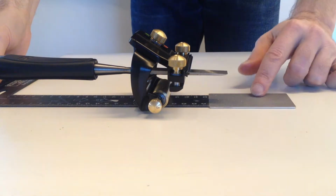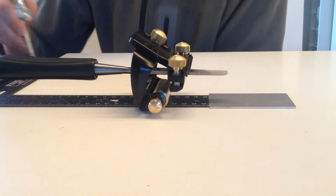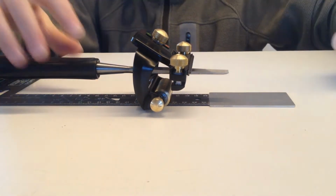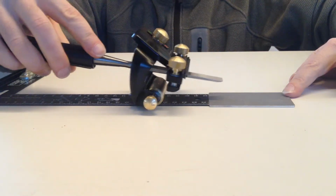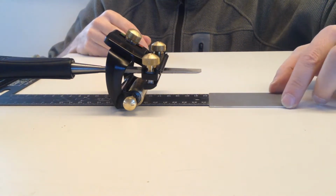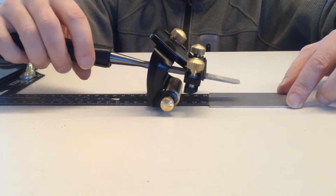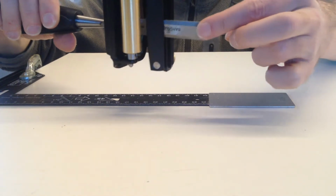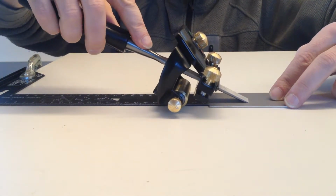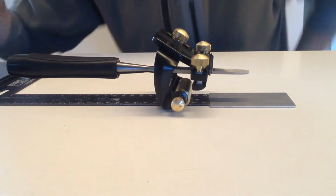What I do is that I'm going to try this setup. So I will fasten my square to the bench. Doesn't go anywhere. Like that. Now this is a smooth surface, they are on the same level, and I'm going to start with the 600 grit setting here, and I'm just going to make some simple strokes here just to check that the contact area here is actually correct. It's the same angle that's already there, and I should be able to see that from the scratches that I make. So I need my glasses.